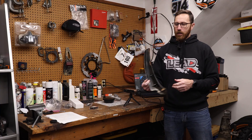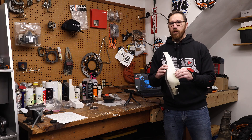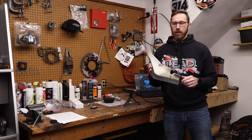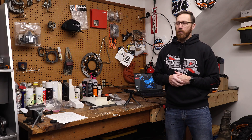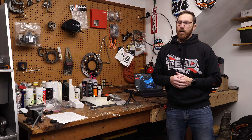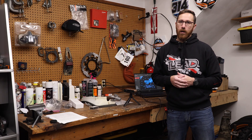With parts like this mud flap, I didn't have much luck in structured light mode — it simply doesn't have enough unique features for feature tracking to work well. With marker dots it's totally fine, but without them there just aren't enough unique edges or features. If you have something with lots of unique features — like a bicycle helmet or a game controller — it works much better. But for smooth, rounded objects with no distinct features, you're going to need marker dots.